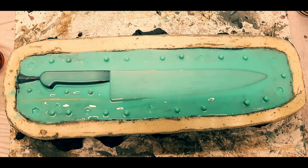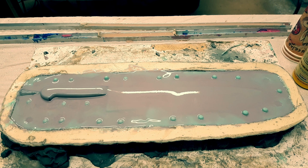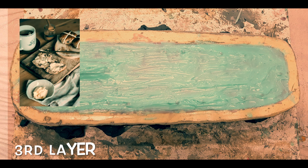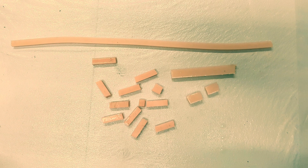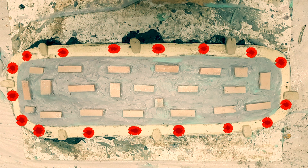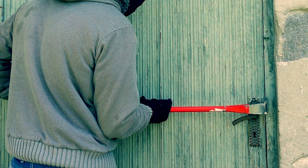I'll do a first detail coat, add some red pigment, then a second detail coat. Take notice in the photos how I try to avoid the Plasti-Paste 2 with the silicone — I try to keep the silicone on itself. If you get a little overspill, don't worry; once it's cured we'll just cut it and peel it away. For the third layer I'll add Thivex to thicken it and butter it on like icing a cake. Don't forget the keys — it's good practice to make your keys the same day you're making the mold, not old ones, as you get a much stronger bond with fresh silicone keys. The fourth and final thickened layer is now on with all keys embedded. I've also drilled bolt holes around the outer Plasti-Paste 2 shell to bolt the two mold halves together when casting, and made little throwaway clay wedges as pry points — just big enough to fit a flathead screwdriver in to help pry the mold halves apart later.